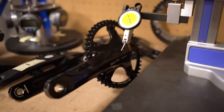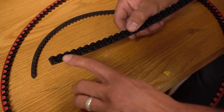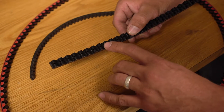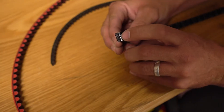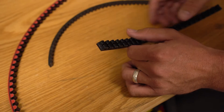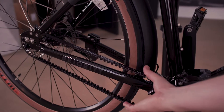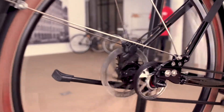There's going to be a polyurethane body, and that's going to be the bulk of the belt. The tooth portion is here, and then there's also going to be a protective jacket on the tooth surface. That not only protects the polyurethane, but it's also going to reduce the amount of friction. If you look closely on the inside here, you can see the individual dots — those are the individual carbon cords inside the belt. Super strong. There's no stretch, no give to it. It's just a really rigid belt.